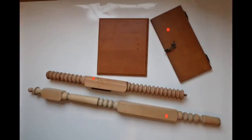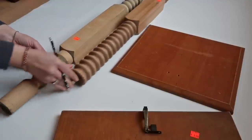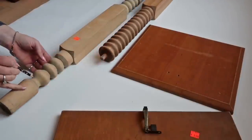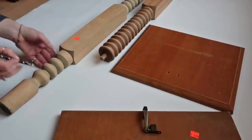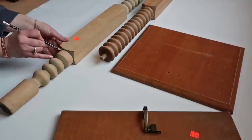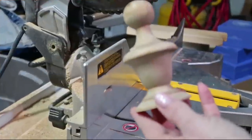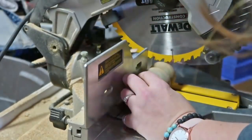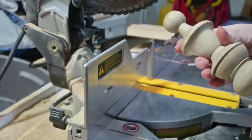The pieces I used for this tiered tray are a few items I picked up from Habitat for Humanity. I picked up two different types of cabinet doors and two spindle-type pieces from beds or headboards. First you want to start by marking where you want to make the cuts depending on how high you want your tiered tray and how much room you want in between each tier. I cut that piece along with a centerpiece of the spindle and I'm going to end up gluing them together to make the very top piece of the tray.